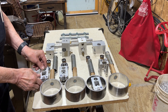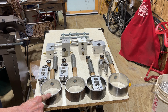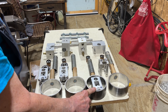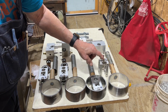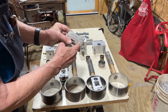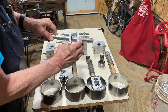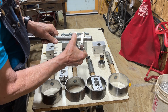These are all of the parts that go into the engine. This is the drive ring. These things are what I call drive shaft rotators — they go inside each of the rings. They have two main bearings and then two smaller bearings that position them inside. The two holes here are what go over the drive shaft and these rotate the drive shaft as they rotate. There are two set screws here that will position it on the drive shaft.